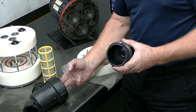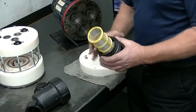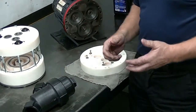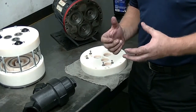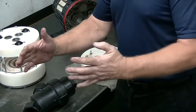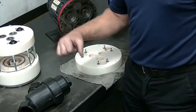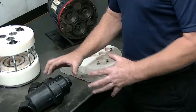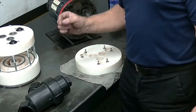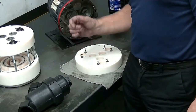Look at the cap — take a few minutes to clean it out, wipe it with a rag, make sure there's no debris, put your filter back in, install it, torque it carefully, and look for leaks. It will not leak when it's on suction — when the pump is running it's a negative pressure, it's pulling everything in, it will pull air in. It's when you shut it off and turn the fluid on with your main tank ball valve open that you'll see a drip. If you see a small drip coming from this housing, it will pull air in. That's an important thing to look for, particularly if you're putting a new pump in.